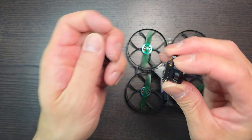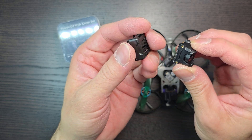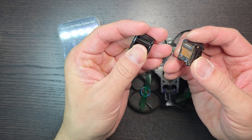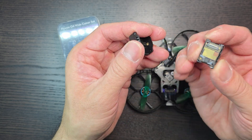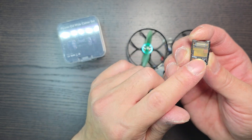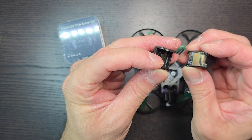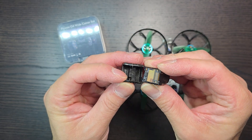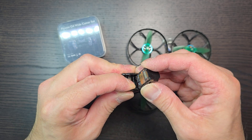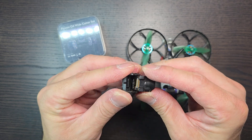Let's first discuss putting the mounting brackets or camera brackets on here. I found it is very stiff to put in and you have to be very careful because if you don't do it correctly you can knock off the chips in the back. What I'd suggest is starting from the bottom of the camera module first and just wedge it in there, then move your way up.